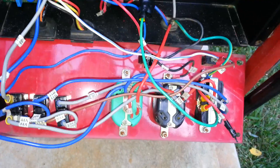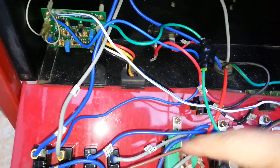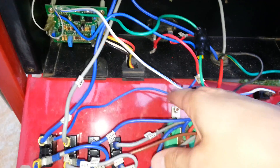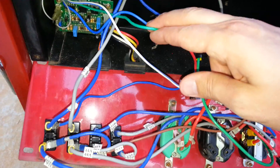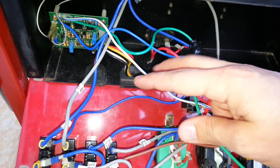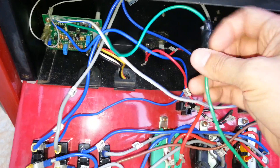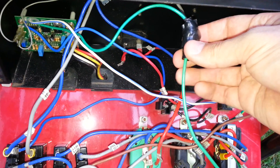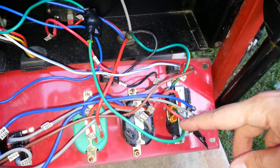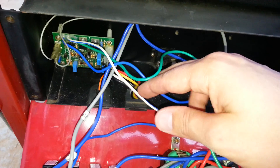There's one more thing you have to do. You have your system control board right there. The green wire was normally connected to the frame right here on this screw. Now that the neutral is no longer connected to ground, this green wire and white wire — which power your auto idle control — need to be reconnected. You'll need to take this green wire and run it to the neutral side of the 120V. They don't make the wire very long, so I had to crimp on extensions, bolt it through, and tape it off so it doesn't ground out.